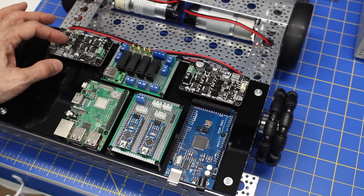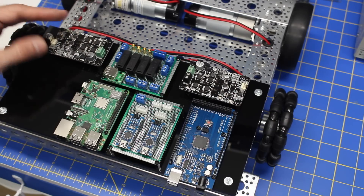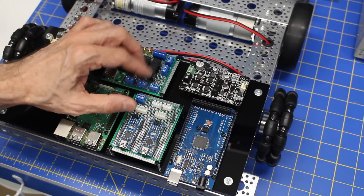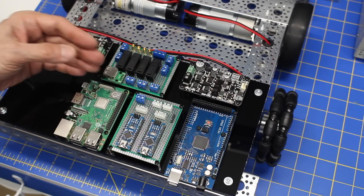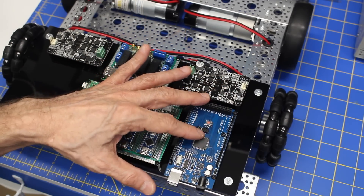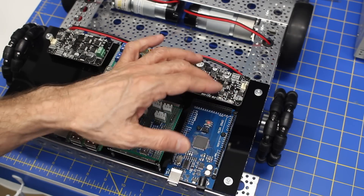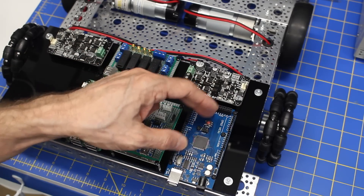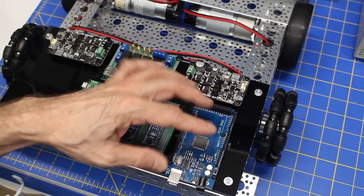So quickly, what the boards all do: the Cytron boards take PWM and direction signals in, and they have an H-bridge consisting of four MOSFETs that power the motors. The power distribution board distributes power, takes the motor power, and does the fusing. The Arduino is where we're going to connect all of our sensors — the sensors for the navigation unit, things like optical and ultrasonic sensors for collision avoidance. Most of these will connect through I2C, but there will also be direct connections. I wanted the Mega for its extra connections, extra memory, and many interrupts — because if we're about to hit something, we want to know about it right away.